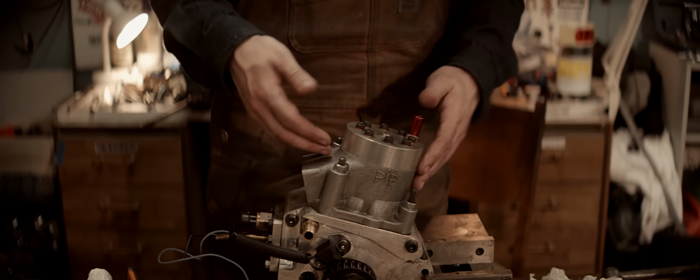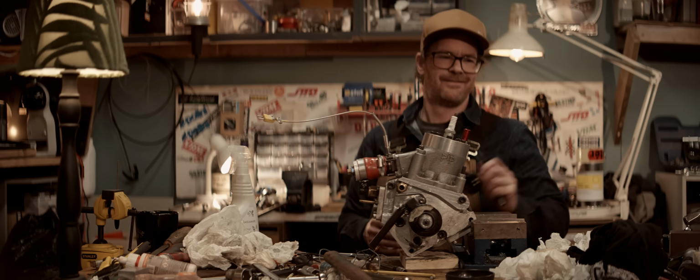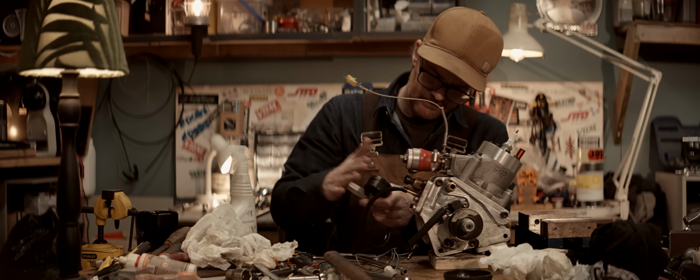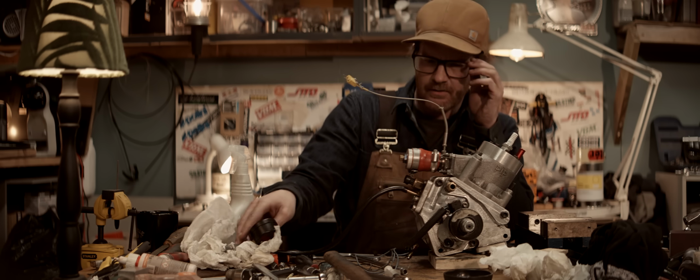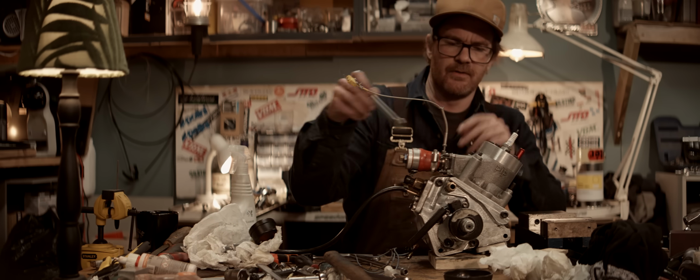And also on the safe side at high RPM, so we're good. Remember how this needs to be tightened last. There's a slight leak in the threads of the EGT probe again. I'll replace that probe with a bolt and a copper washer for now, just to make sure there's no other leaks.